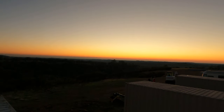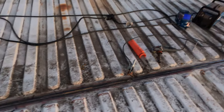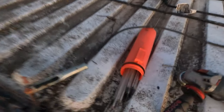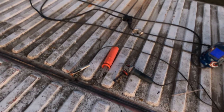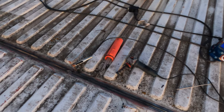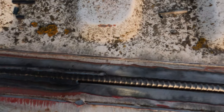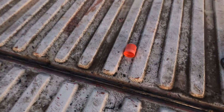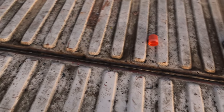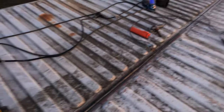The sun has set on the horizon, but you can still see the containers pretty well with the sun reflecting off the sky. I'm about halfway down and I've made pretty good progress — burned quite a bit of rod. I've been burning both the 3/32 and the 1/8-inch 7018. In some cases the 3/32 burns a little bit easier, but where it's almost flat to the container the 1/8-inch was working better. Back over here I had a little bit of a rough time — I got a ton of porosity, and it was pretty clean to start with, so I'm not sure what exactly happened there. You can see the absolute mess of slag all over, and that's the only downside to stick welding — you get quite a bit of slag.